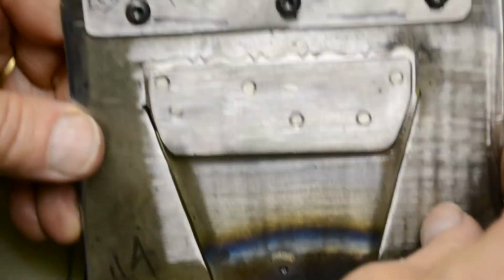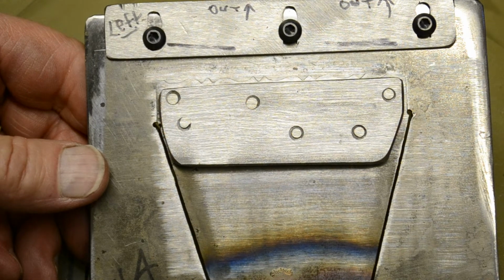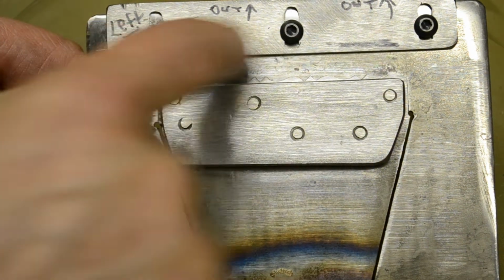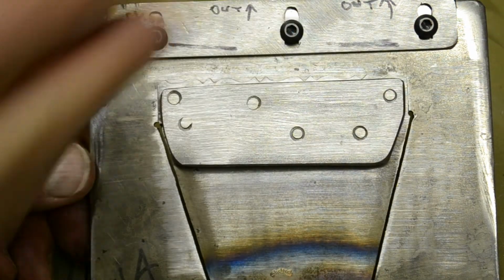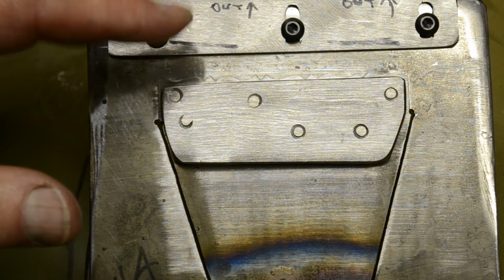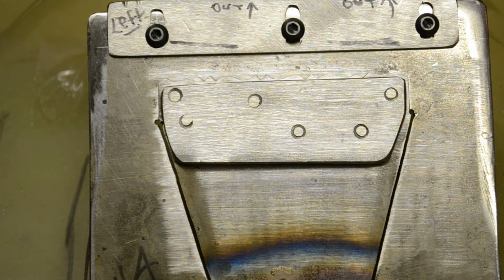Oh yeah, that's one more thing I want to keep reiterating. For a lot of half-round wire and load-on wire, you don't even need this stop. You just load it in there where you want it, and if your wire is perfectly flat, it'll cut it. It won't scoot around. With triangle wire, it behaves a little differently. Sometimes it might behave. The die might hold it down well enough, but you don't necessarily want to rely on that happening. So that's why the adjustable stop system is available, to make sure that the triangle wire in particular, doesn't scoot around